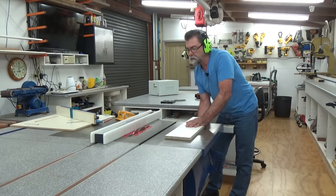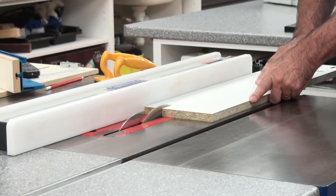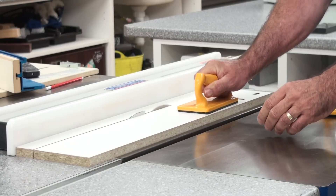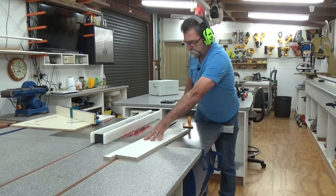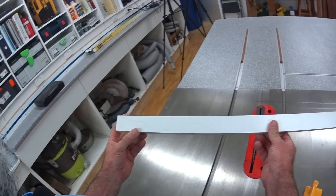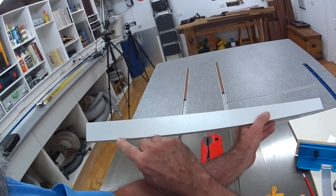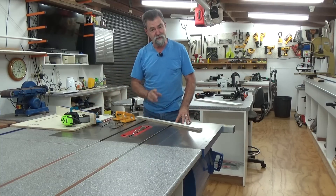These things are very, very good — make sure you use them. It really isn't a hassle to use them; I don't understand why people don't. Here we go — you can see the profile there on the blade, a beautiful profile, with push blocks. The riving knife doing its job. That is absolutely beautiful. This is the area we've done before, and this is the one I just cut — not a mark anywhere. Even using a cheaper quality blade, you will still get an extremely good cut from doing this method.